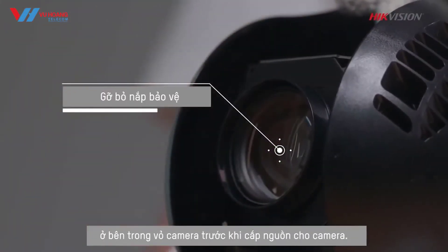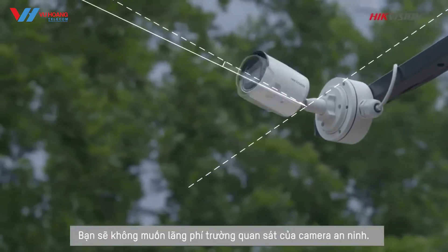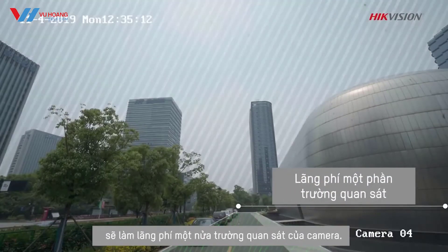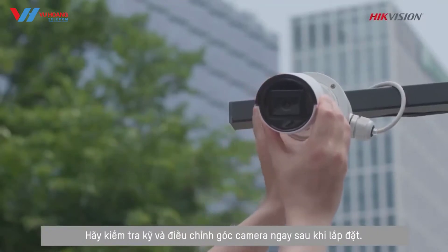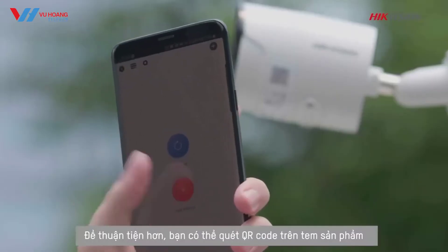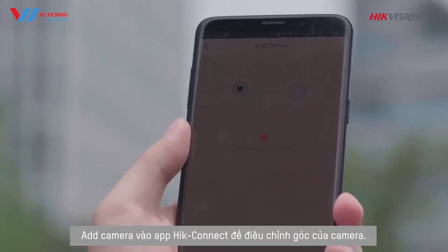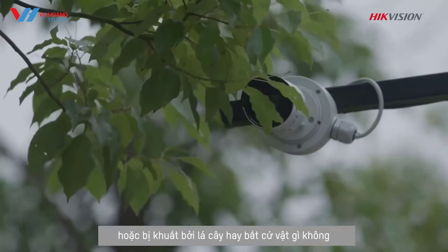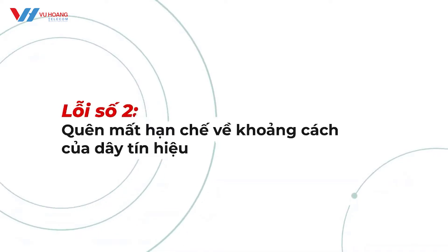Number three: obstructed installation angle wastes field of view. You don't want to waste any field of view if it is for security. Installing a camera at too steep an angle will waste about half of the field of view. We suggest double checking and adjusting the camera angle right after installation. To make things even easier, you can scan the QR code on the sticker to add the camera on the HikeConnect app while adjusting the angle. Also use the app to check whether the camera's field of view has too low an angle or is obstructed by leaves or anything else.